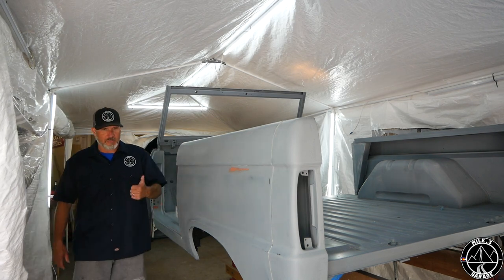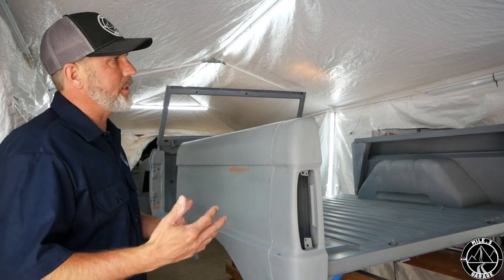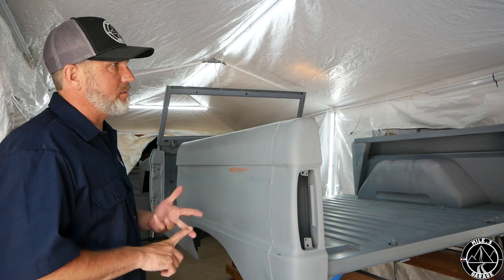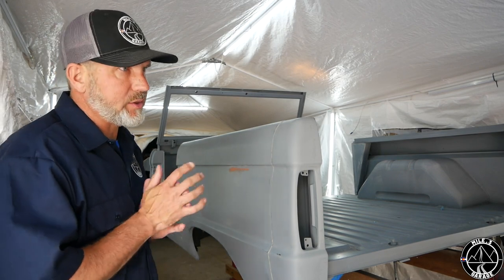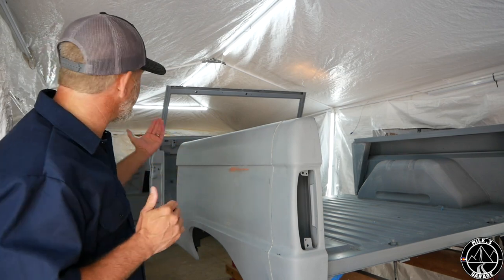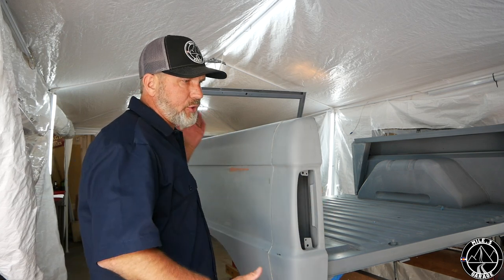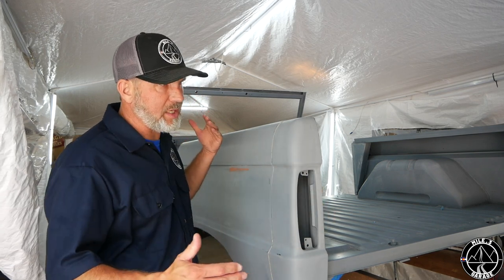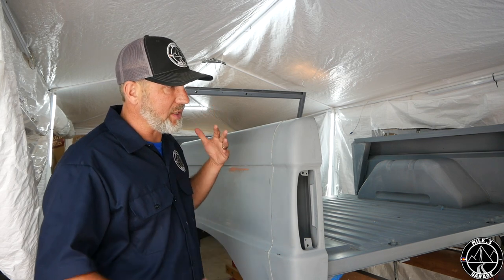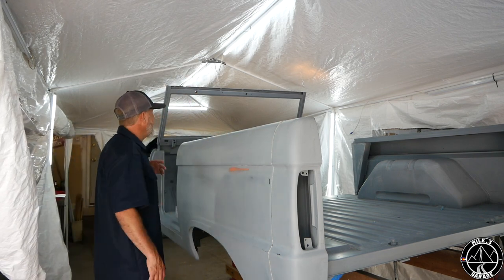So far the lights were $100 and I used those for the shop, so I'm not going to count those. So the lights were free. The tent was $60. And duct tape will probably be about $20 for enough to close it. I'm going to buy a couple more box fans for the intake. So I'm going to have probably 2 pushing and 2 pulling, and the 2 pushing will be smaller than the 2 pulling. So it'll be a negative pressure booth, but not so much that I think it'll suck any dirt from anywhere else. We're going to have the floor taped. So that's kind of where I'm headed with this.